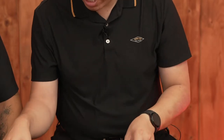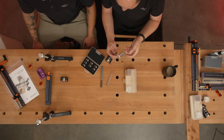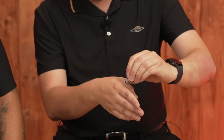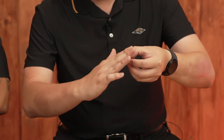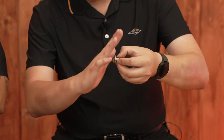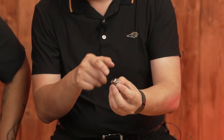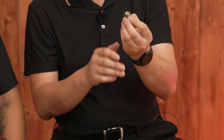And for these dies, over time, if you do need to sharpen them, use a half inch drill chuck. Grab a drill, grab onto the shaft part, find the bevel, and use a flat stone. Run your drill and put that flat stone or sharpening block up against this, and it'll resharpen it. Use 5,000 or 8,000 grit specifically because you're trying to hone it. You're not actually trying to sharpen it.